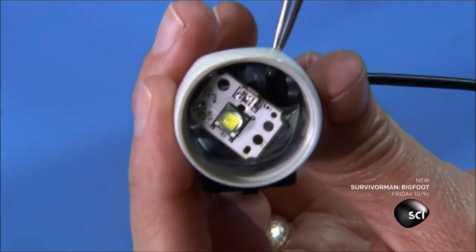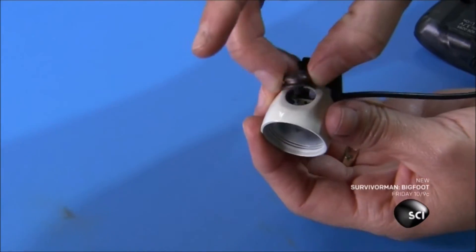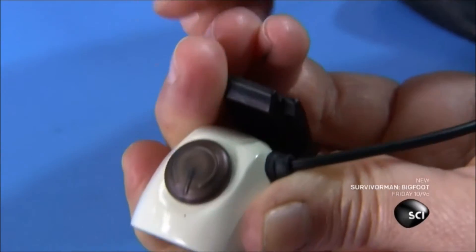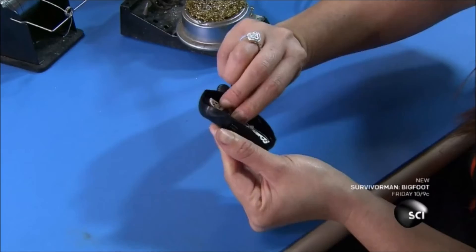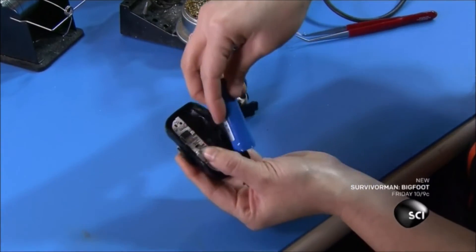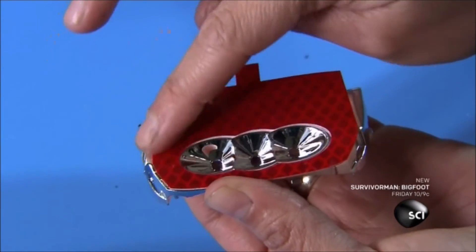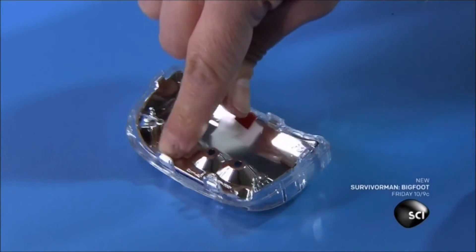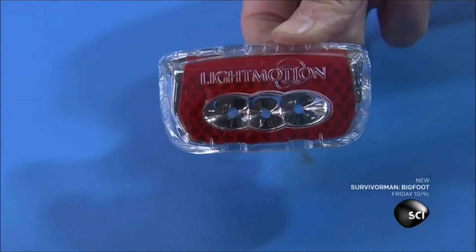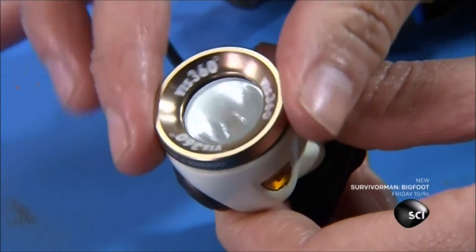An employee builds a smaller bike light for a cyclist's helmet. She inserts the LED assembly in the canister, then attaches the on-off button. She attaches the light to a circuit board with three LEDs, then tucks the circuit board into the housing and inserts a rechargeable lithium battery. She puts the assembly aside and attaches a red reflective panel to an aluminized reflector, then snaps the assembly into a clear plastic case, completing the rear light lens. She returns for the front helmet light and installs a reflector over the light, then screws on a glass cover framed by a metal bezel.